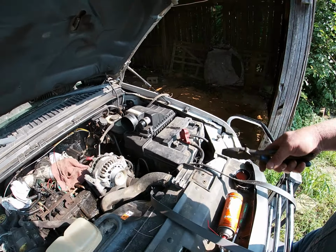Well, here's something that I find very, very interesting. So I started with the top idler pulley here, pulled it out, and there it is. It's got a bearing in it you could knock out and replace, but nobody carries those, so you get the whole pulley assembly, right? New bearing and all.